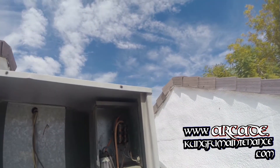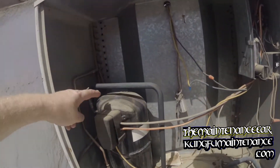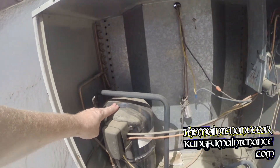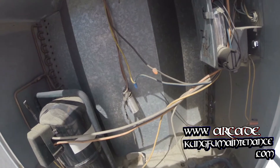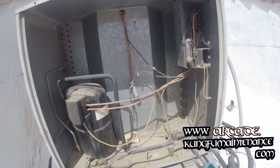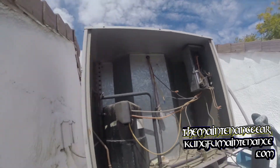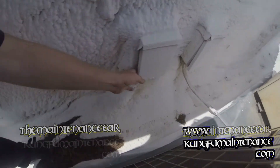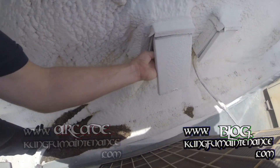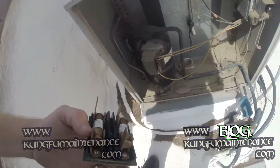Very careful — we still got power. The contactor is pulled in but we have no power. I feel the compressor; it's not too hot, so that's a good sign. So maybe we just blew a fuse, and maybe it has to do with that dangling capacitor. That's definitely not good. So I'm going to pull the disconnect and trace our conduit back to make sure we get the right one — this one here. I can check my fuses back at the shop.